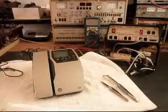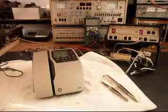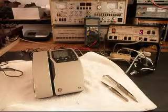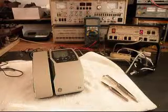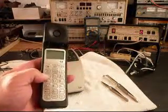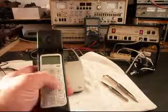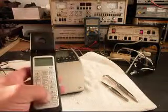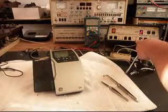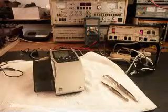Basically what we want to do now is our final checks. We'll go ahead and ring the telephone — we'll let that go a few times — and we'll go ahead and answer it here. Give you some dial tone, and I want to go ahead and dial our numbers out. If you watch the analyzer, you'll watch the numbers go by. Now I want to transmit into the handset. If you watch this red light here on the analyzer, every time you see that red light, that's an indication of 100% modulation on transmit.